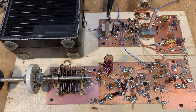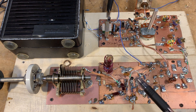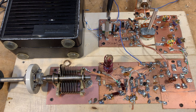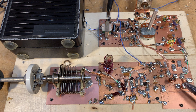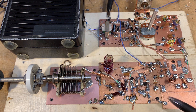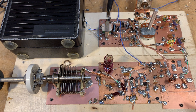This thing is really simplified now, and I kind of like it that way. We're getting to a point where there are two transistors in the VFO and two transistors in the audio frequency amplifier. I think I could get rid of the second transistor in the VFO — it's just a buffer. Because the mixer presents a pretty stable load to the VFO, it's possible we could get away with removing that buffer transistor. The whole thing would then have three transistors and just two diodes in the mixer.